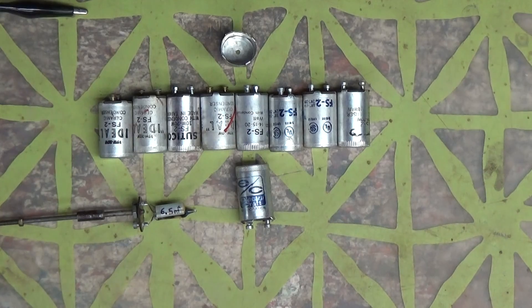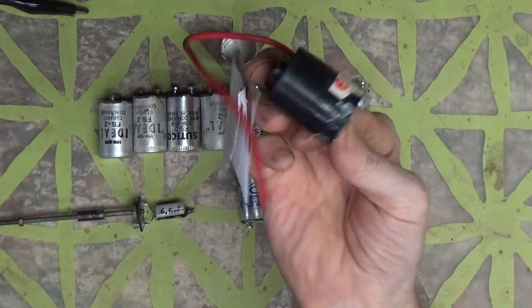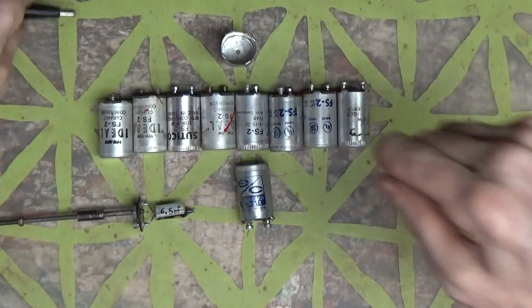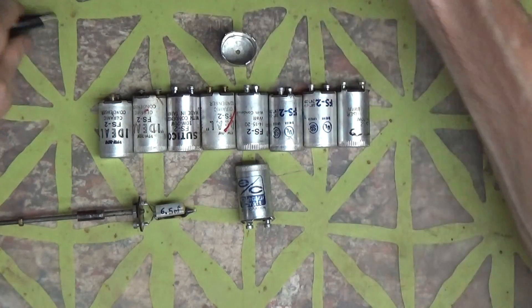This is part of a video that coincides with this bug zapper unit over here. The transformer is toasted — I'll show it at the end. I'm going to try to replace it, and that'll be the next video. But enough about me — I've got the dim bulb circuit over here hooked up with the isolation transformer.